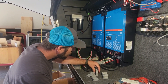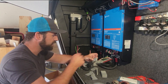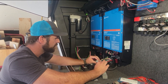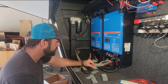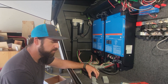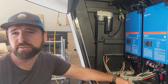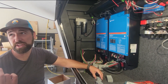What's different about these blocks compared to what would normally come with the enclosure? The normal approach would be floating block splices that you have to put heat shrink over because they're not mounted to anything. These Wago connectors are DIN-rail mounted, so they don't move around. The DIN-rail mount terminal blocks are going to work beautifully — we're going to be doing this a lot more often.